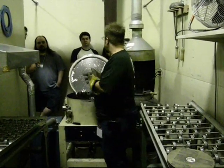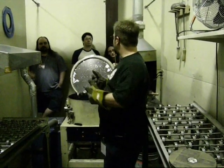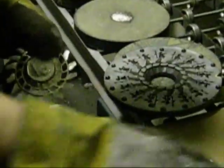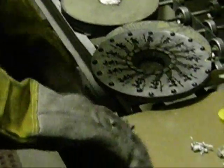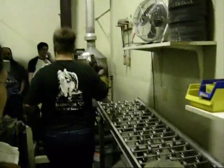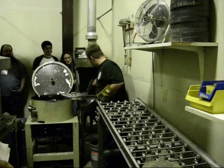When we notice that is going to happen, we throw the mold out and make a new one. We can get 100 or so — a lot more than that if it's a simple, clean, flat piece with no undercuts or sharp edges. So we've got all these castings here, and anything that doesn't come out usable we just put right back in the melt.